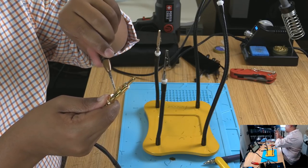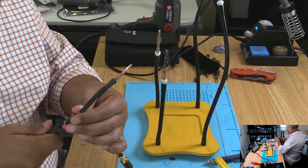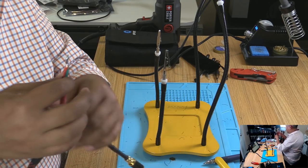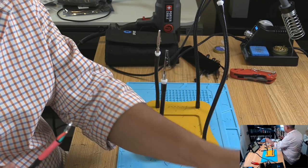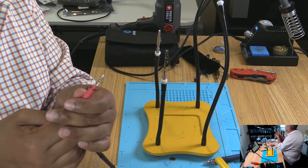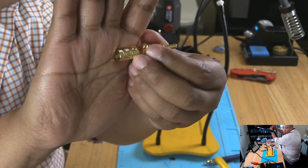Because why, you ask? Because I have to put the red shrink wrap over first. Let's do that. Let's get this tape off. And again, the rule is bring the red shrink wrap up to the point where you see the screw marks from the bottommost part of this thing, because you don't want to put it over. It'll make it so thick that it'll be really hard to screw that in, and that might cause those screws to stick out, and if they stick out, the barrel will not move smoothly over.